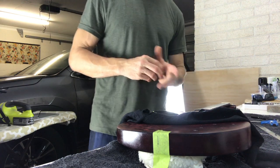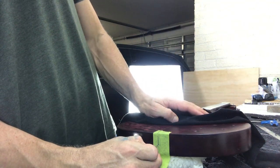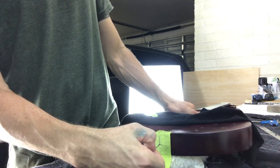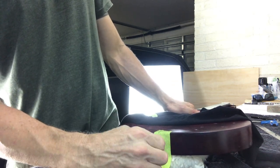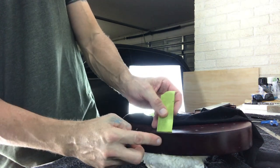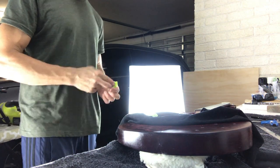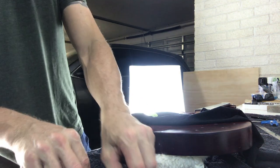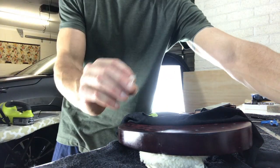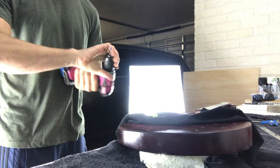What you do next is just put an indent in the body on that spot. I've just got a precision screwdriver to ground the top to a sharp end. You can simply remove that tape. So from here, we're just going to drill our pilot holes as we did before, but this time our screws are a little bit larger than the holes for the tuners.